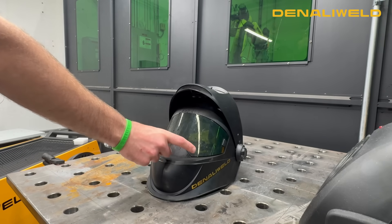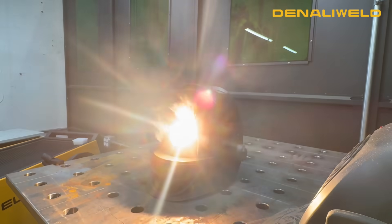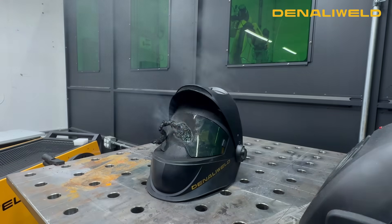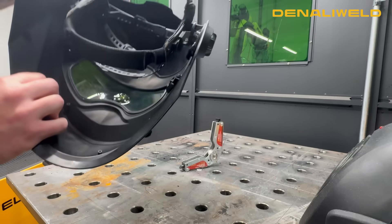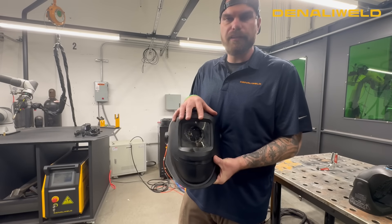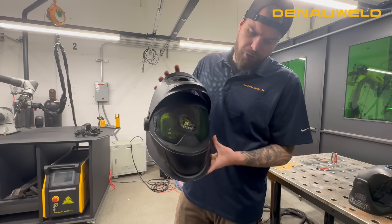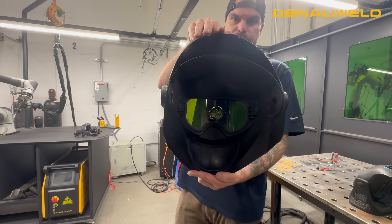Laser safe glass — nothing was penetrated through. You can see it did deform the outside of the glass, and on the interior it is bubbled through, but there is zero penetration on the inside of the glass. As you can see, the laser did penetrate our outside cover lens, which is to be expected — that is not laser safe glass. Inside of that is where your ADF is; again, it is not laser safe. When I flip open to the laser safe glass, you'll see that it did burn some of the glass. However, the laser safe glass did do its job by not allowing any laser penetration to the operator.